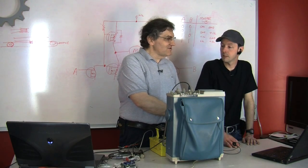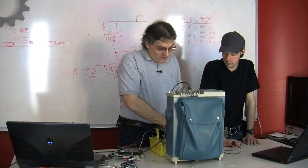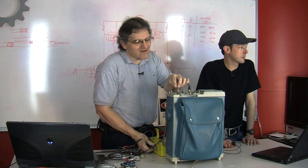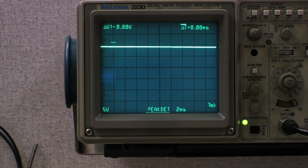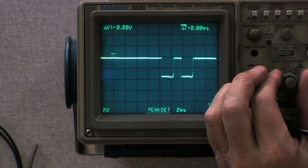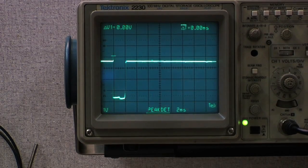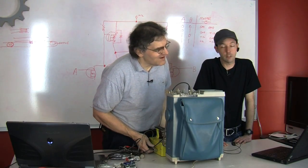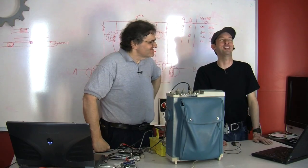It's being used as a one-shot, so it's like one pulse per event. We're actually reading the output of the detection circuit upstream from the metering circuit. You'll notice yours has a much smaller but cleaner pulse — that's because you're reading the output of that one-shot. My pulse is larger but dirty, whereas yours is small and clean with smooth edges — we're getting about a two-millisecond pulse duration.